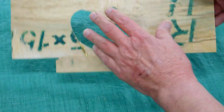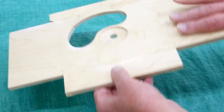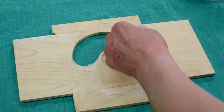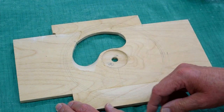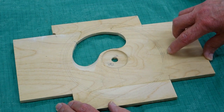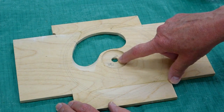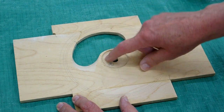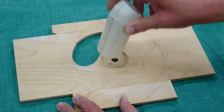I have a piece of junk plywood — it's really nasty on the back side, not sure where I got it, but nobody's going to see that side. I take my template, lay it on there, and cut it out. I made a piece that would inset, pick up, and fill in the back side, and added a piece over here. I've drawn seven, seven-and-a-quarter, seven-and-a-half, and eight-inch diameter circles as a reference. I drilled a half-inch hole so I can spin this on my circle sanding jig on the disc sander, and while that was centered on the drill press I started drilling a one-and-seven-eighths inch hole, which will just fit an inch-and-a-half piece of plastic pipe.